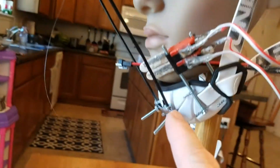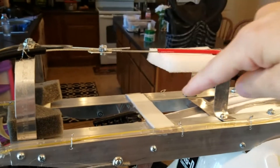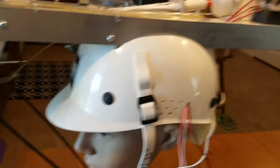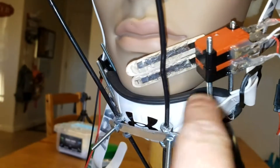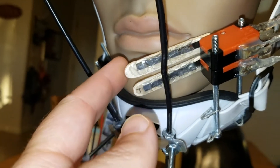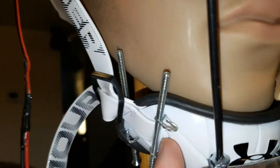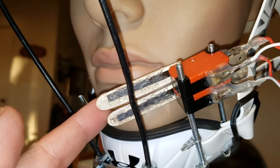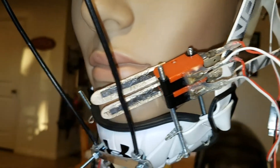With the electronics, on my first costume I didn't want servo noise, but with the Bluetooth speaker that's going to sit right up here, there's so much background noise of the alien breathing and everything, so I'm going with servos this time so I can get that inner mouth. These two switches — one controls the mouth, one controls the lips. I need to remove this hardware because I had to have them both on one side so that my tongue can hit both of them when I want the lips to open and the mouth to come out.